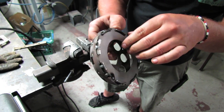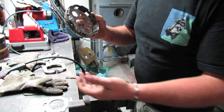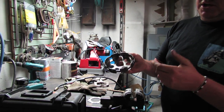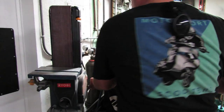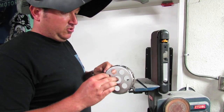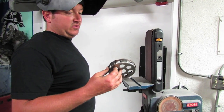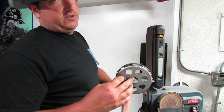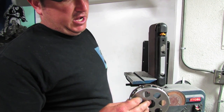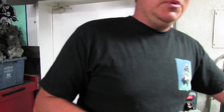With welding done, we'll clean up the welds. You can use a grinder — we've got a couple of belt sanders at the shop. As for TIG welding, a lot of people say TIG everything, but I personally prefer getting it done as quickly as possible as long as it's equally effective. Some people TIG weld without any filler metal, just heating the band to the basket, but we're dealing with old Vespas here.